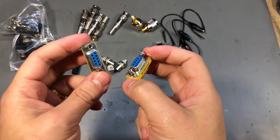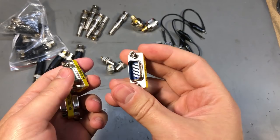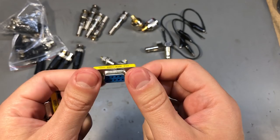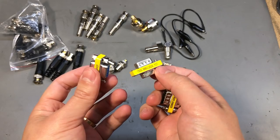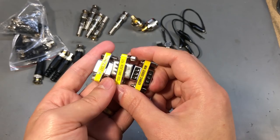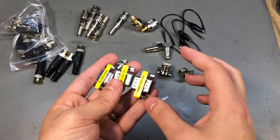This is the last set of connectors I'm showing in this video. I have a set of adapters for DB9 type connections — these can work as a gender changer, both female and male, and the third one is just a male to female adapter. With a set like this you should be able to connect your DB9 serial debug connection in just about any configuration. I highly recommend you get yourself a set of these if there's even a slight chance you'll work with DB9 connections, because I've encountered so many styles of DB9 connections on various equipment I had to service.